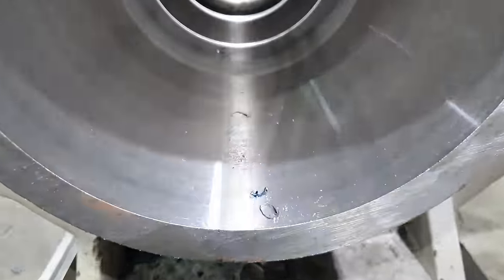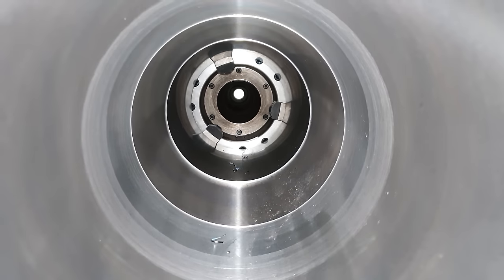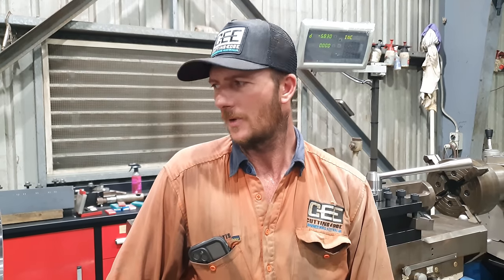Righto, so I've got that barrel bored halfway and to within half a mil of its finished size. Something like this we would generally outsource, or we would have to tell our customer the material is not available. So now with our new tool post, we can do everything in-house, but I think I'm going to need a bigger boring bar. So I hope you enjoyed the build of our shop-made tool post. Thanks for watching.